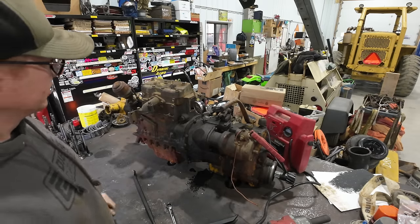You guys see that thing wedged in between the gear case and whatever else that thing is there? That's a gear tooth down in there, it looks like. I haven't figured out where it came from yet, but it sure looks like the profile of a gear tooth to me. Looks like I probably can't get this gear case any further apart without splitting it from the engine side, so that is my mission right now. I think I got all the bolts out. Hopefully, this gear case will come off.